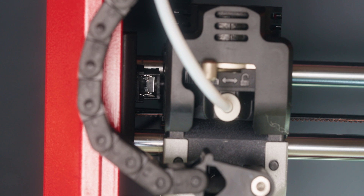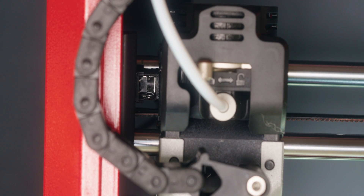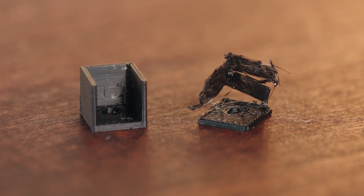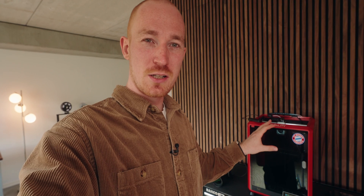I'm gonna start the first print and see if it actually does the timelapse. The first attempt failed horribly. During the priming process the printer just crushed through my button, so that's broken and I have to re-solder a new one. It also never tried to push the button afterwards, so something with the script isn't right. And the final printed product is horrible — just a full piece of garbage. There were some details to fix: I had to change the start G-code so it doesn't go all the way to the side and crush my button, and I tried a new G-code for the timelapse.